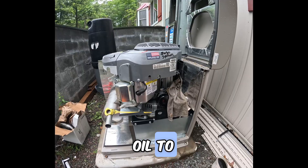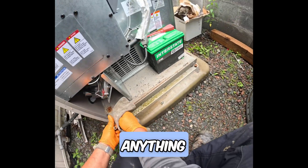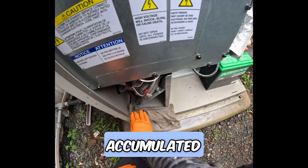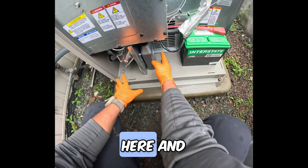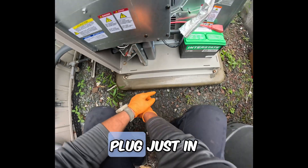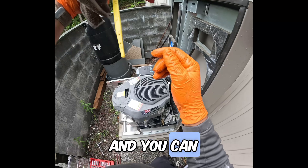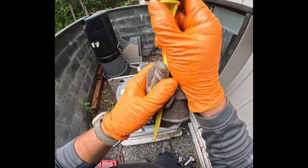So while I wait for the oil to settle, there are a couple other things you can do — looking for burnt wires, frayed wires, anything like that, because rodents can get in here. I'm just cleaning up any of the oil residue and dirt that has accumulated for the year. You can always store some extra resources here inside this cabinet to make sure there's always oil on site and a spark plug, just in case of emergency. Let's go ahead and check the oil level one more time — and you can see here that it's at that line. Perfect.